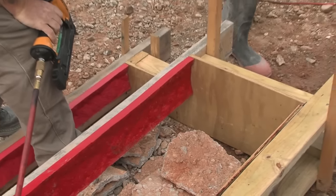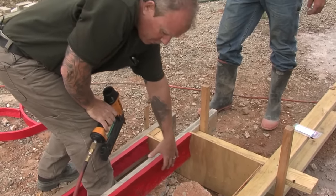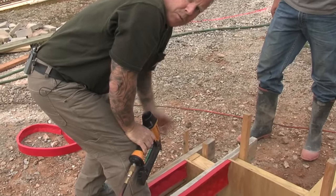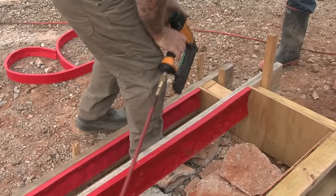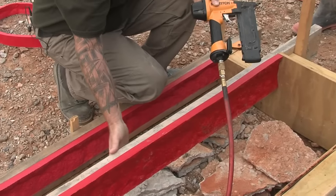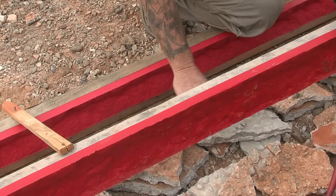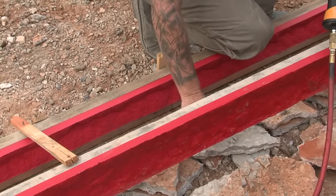It's literally that quick and simple. Now we're going to have a beautiful architectural finish when these stair risers are stripped. One other consideration: it's not a bad idea to 45-degree the front edge of this 2x6, so that when we're floating the stair treads we can get our hand floats and our trowels right up tight.